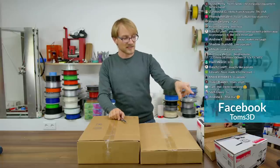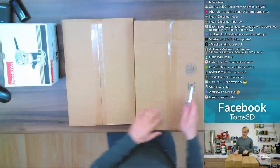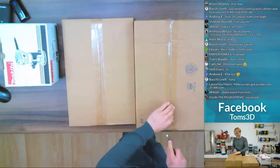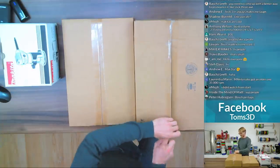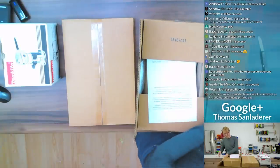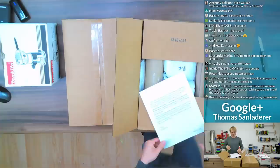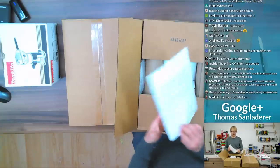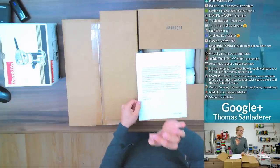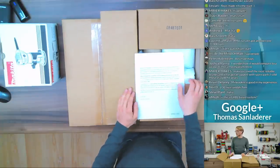Yeah, so I went for this. This actually goes to 30,000 RPM, which is quite a bit. This is actually quite a bit more than what your cordless drills or even regular drills do. So yeah, great for using small diameter milling bits. You need a lot of RPM to get these small mill bits to work.